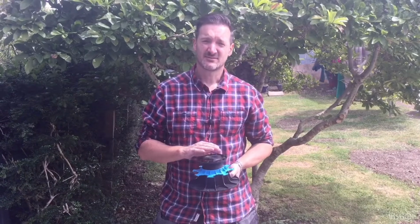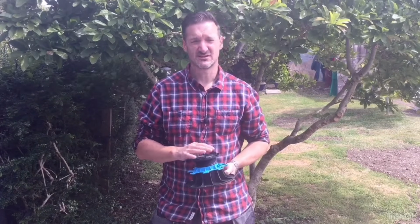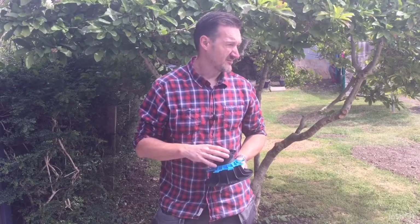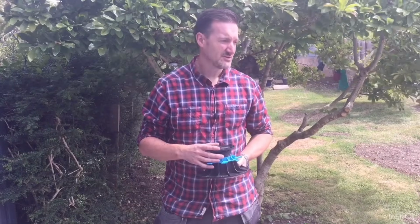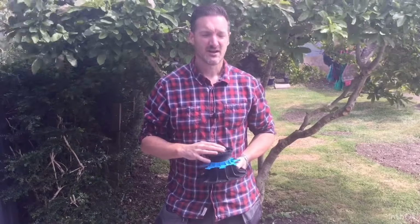Okay, so that's been my review for the Jouplast 80 to 140mm pedestal. These are designed to be used with 20mm porcelain tiles. You can use them with slabs as well, but you do need to check with the manufacturers that the tiles are suitable for that use. Personally, I think it's a great idea. It gives you a completely free draining patio. It allows you to bring the patio level up close to DPC.